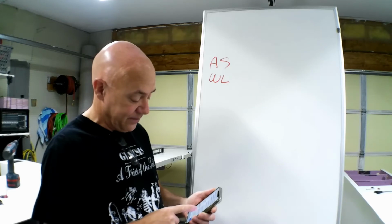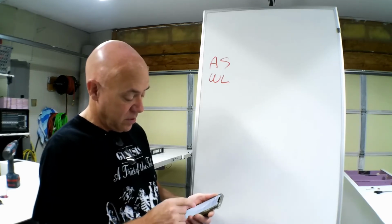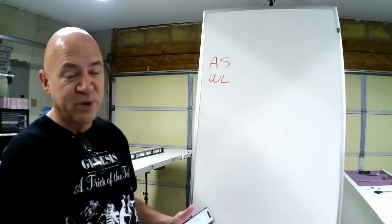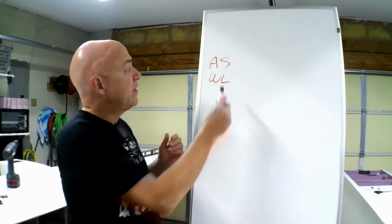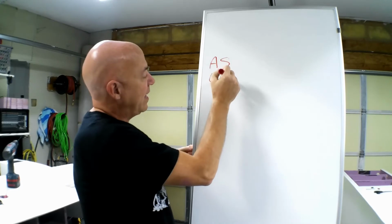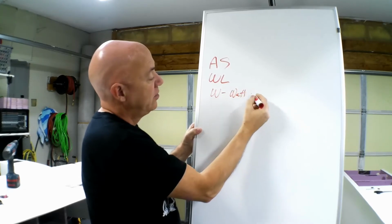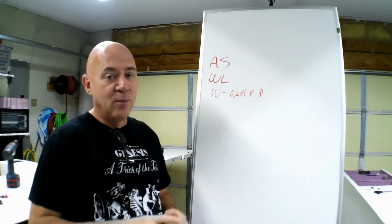Hang on. So if I had a 16 pitch at 10,000 RPM, yeah, I'm going to be going 151 miles an hour prop speed, which will put you in about the 130 mile an hour range. So you need to think about your airspeed, your wing loading, and then you take the true weight of the plane, and then you look at your watts per pound. And if you're an aerobatic airplane, the more watts the better.